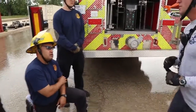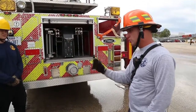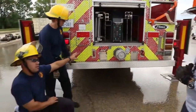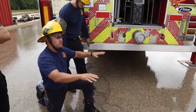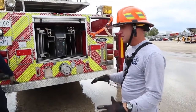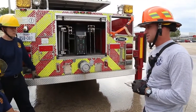Electrical failure. If you have electrical failure, then it's not going to power that motor. If you remember, it's an electrical motor that's air cooled, that's going to lower the device. You have an electrical failure, now you may be dead in the water, okay? But does this run on the 12-volt batteries that are on the side? Yes, on those batteries. So for some reason, if these batteries just aren't going to work, no bueno, EPU you're not going to work. Or if you drive through a puddle of water and there's electrical or computer malfunctioning, electrical does not like water, you may be messed up on EPUs. Those are the two. Yes, okay.